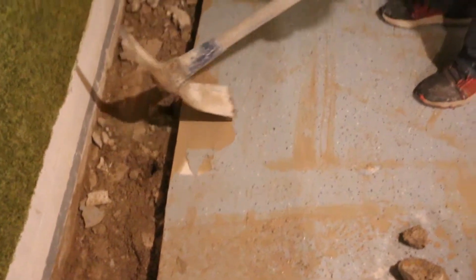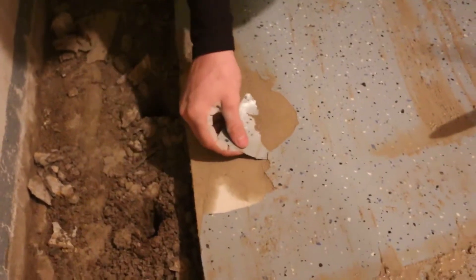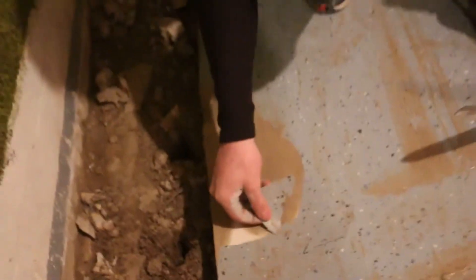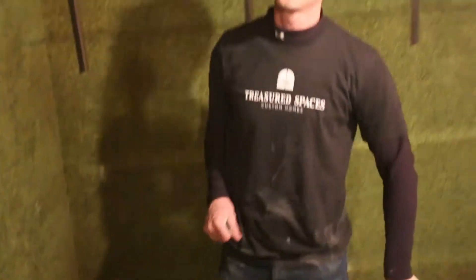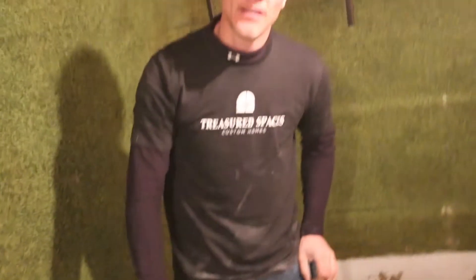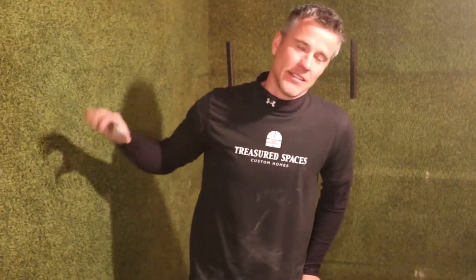Sometimes people think it's painting the floor with an epoxy or a waterproofing paint. This one's had epoxy on it — as you can see, it doesn't really stick. That's because of the moisture coming up from below, so it doesn't bond like it's supposed to. Some people paint their block walls with waterproofing paint — looks like there's a couple of coats on here, along with this fancy green carpet. But those things might seem like a good idea; they don't usually work.